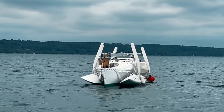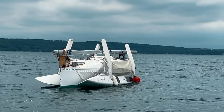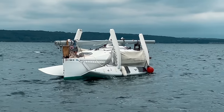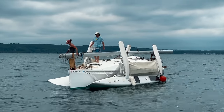This took an agonizingly long time to drop the anchor. Kirk was suspect of the basket to begin with, and this situation proves that a roller with an anchor locker for uncoiled rode is really a necessity. If we had somehow secured the rode in a ready-to-toss-overboard sort of way, this would have gone faster, but clearly we need a better long-term solution.